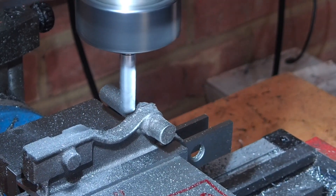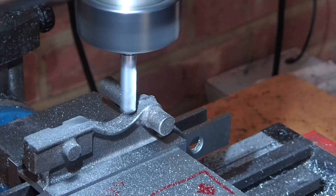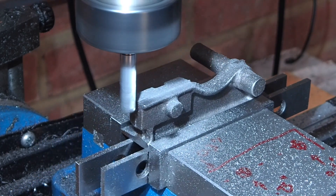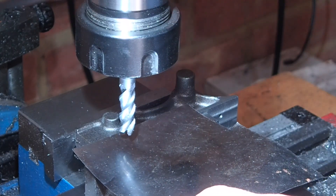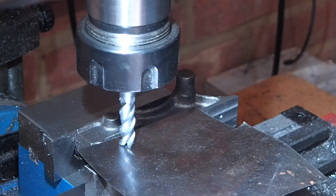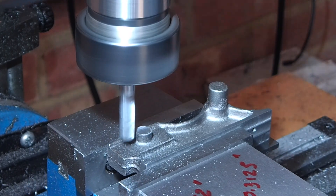I'm just running the milling cutter over here to make sure it's no higher than the top of the main frame, otherwise it'll knock it out of square when I hold it in the vice. With the frame mounted on its side I can now machine the bushes for the pivot pin and the crankshaft to height. I'll start by touching the tool off on the side of the frame then I can set the height on the DRO. Machining the bushes down is a very straightforward task.